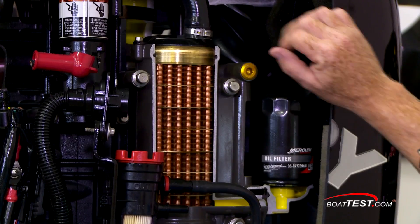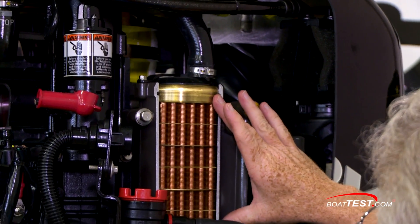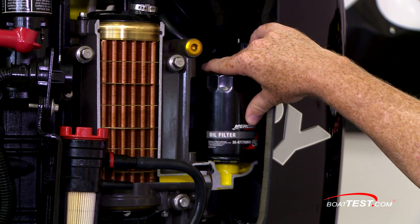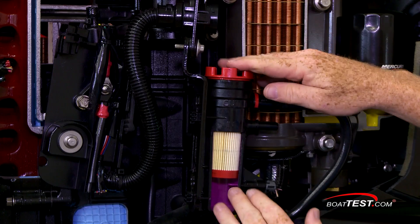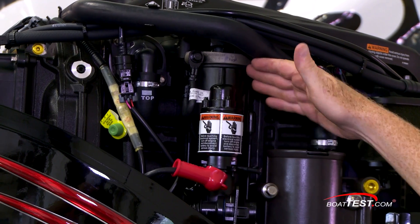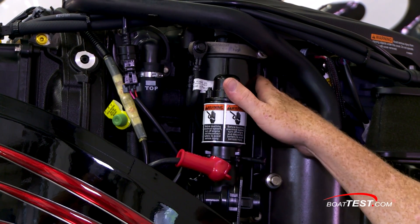On 150 horsepower and larger engines, Mercury uses seawater to cool the oil and maintain the optimum temperature. The oil filter is upside down, so when changing filters there's less mess. The water fuel separator traps any water in the fuel and sends a signal to the helm alerting the need for a filter change. The 300 utilizes a high-torque starter with a gear reduction unit, and Mercury paints the starter with a melamine coating to reduce corrosion.